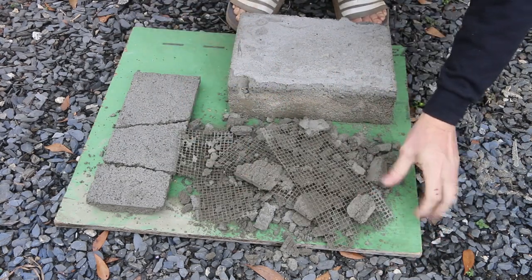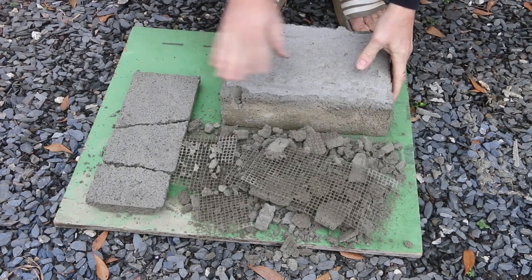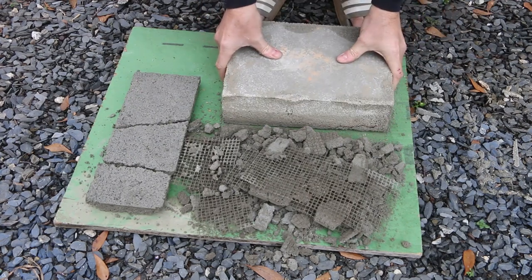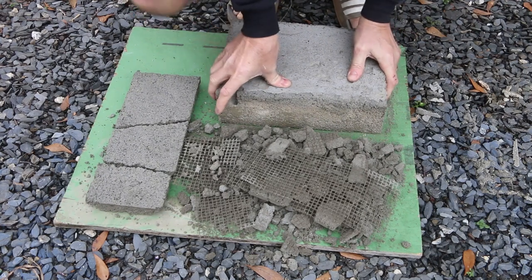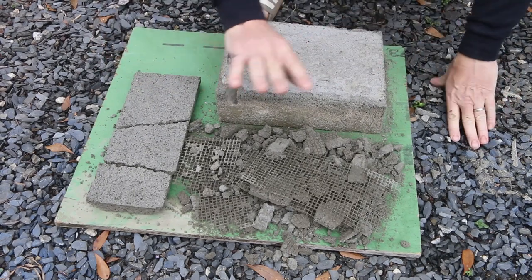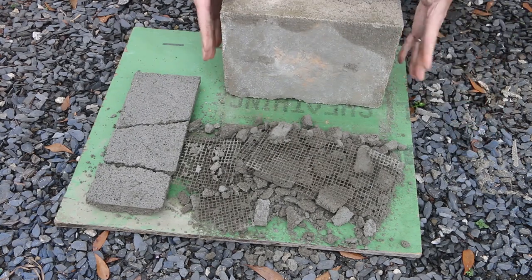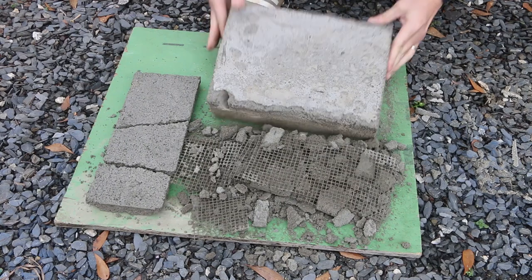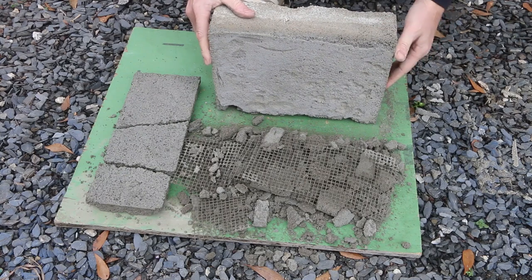That failure may have had something to do with my foam. I used a foam-to-concrete ratio that someone suggested in the comments and I just think there wasn't enough concrete in that mixture — the foam held up okay but there's just not enough strength left. And this block from the same batch is nice and light, there's some rigidity to it, but it still gives under pressure. So conceivably the problem was with the thickness — something like this might not be used structurally, but it could definitely be used as a piece of insulation. So perhaps not a complete failure there.